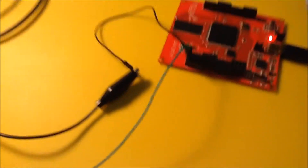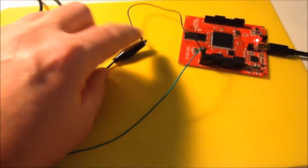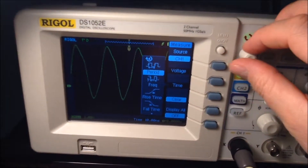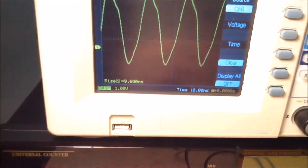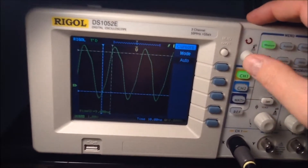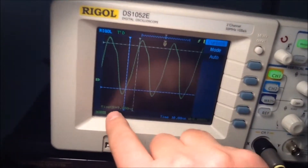I'm using a quite naive way to probe the clock. I have this earth loop attached to the ground of the Papilio and a jumper wire to port A0, and that gives me a quite ugly display. If I measure the rise time of my signal, I see 9.6 nanoseconds. We can see that it's taking 10% and 90% of the rise time for this measurement.